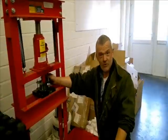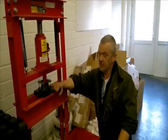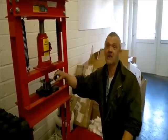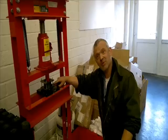Okay, so here's the mould, and you can see it's a really simple homemade thing. It's two pieces of plate steel and a bit of pipe in between. We poured the plastic in, heated the whole thing to 135 degrees, put in a steel plunger, and pressed it down. And in there, we've got a layer of our plastic.